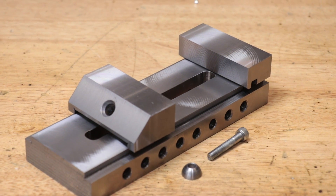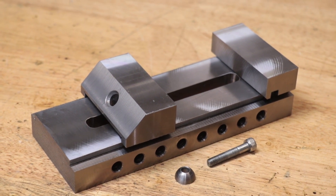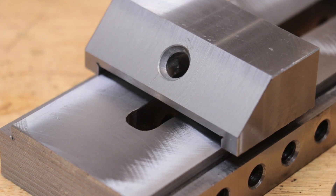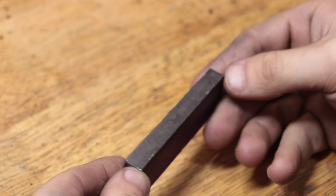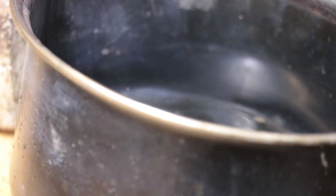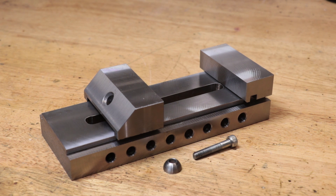At this point I'd love to show it working, but since I made everything oversized the jaws won't fit on the main body - but that isn't the main focus at the moment. If you look closely at the parts you'll be able to see a bunch of nicks, scratches and dents which have been picked up over the several weeks it's taken to machine these parts. The nicks and scratches are easy to get because the steel is soft, at least relatively. If this was a regular medium or high carbon steel we could heat the part up, quench it and it would be harder. But because it is a low carbon steel, heating it up and quenching won't change the hardness - and for a toolmaker's vise, which is normally hardened, that is a problem. But that's a problem I'll tackle next week. I hope you enjoyed this video, thank you very much for watching, see you next week.